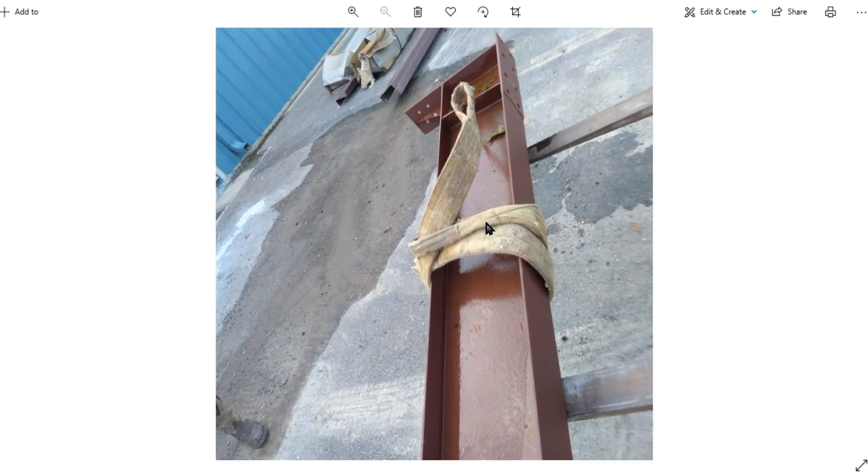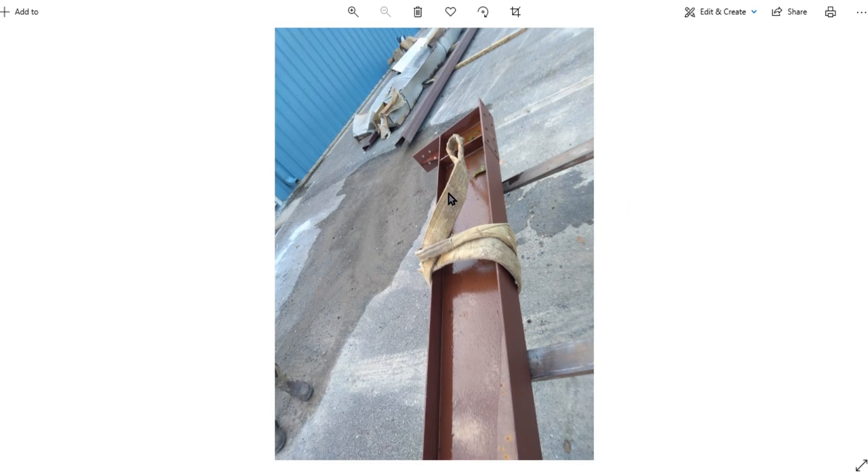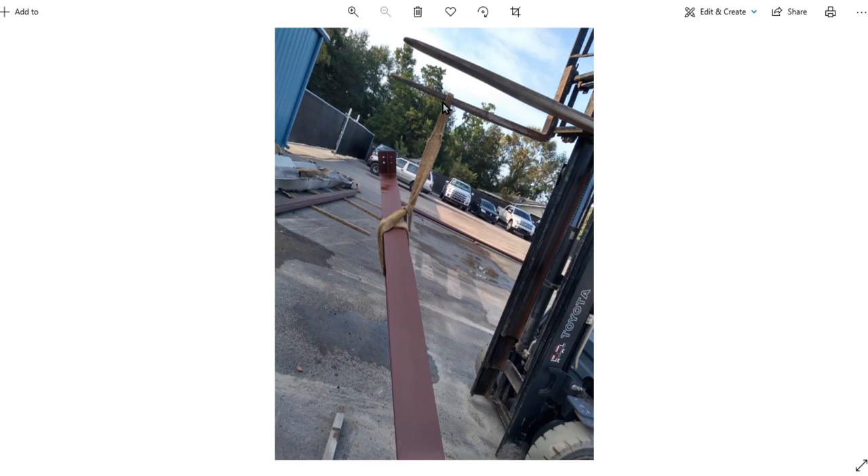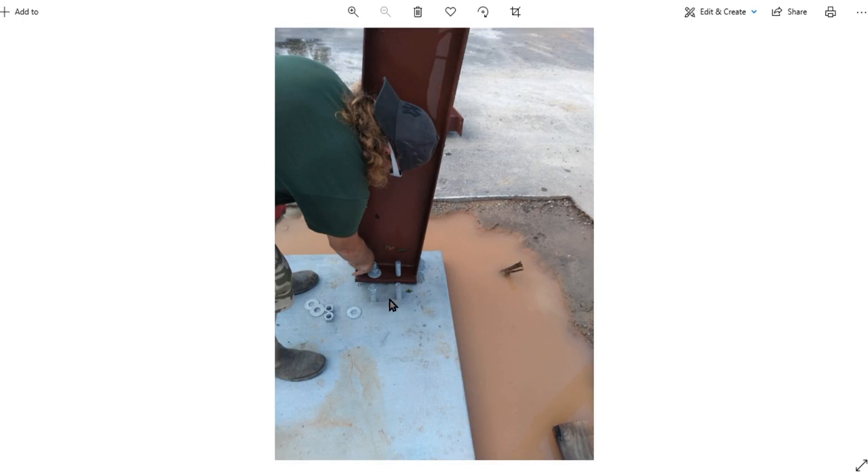When you're hanging these columns, it's good to have a good thick choke strap. You don't want to put chain on here — chain can slip and pop and you end up dropping that column on somebody. Pick it up, get that choke strap wrapped twice and choked, and hook that choke strap up in the fork. When I did this as a kid I always used a boom truck or crane, but it's a lot easier and faster with a forklift to put these steel buildings up. Just raise it up and hang it over the bolts and have a man there to guide it down.